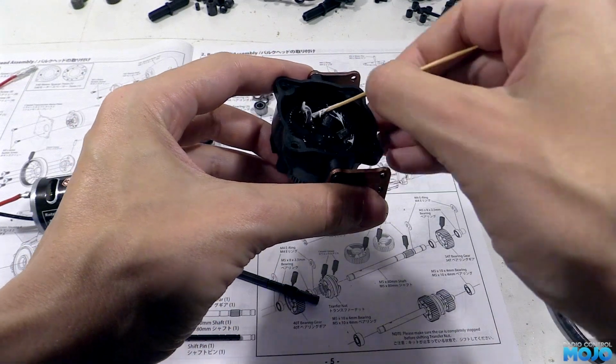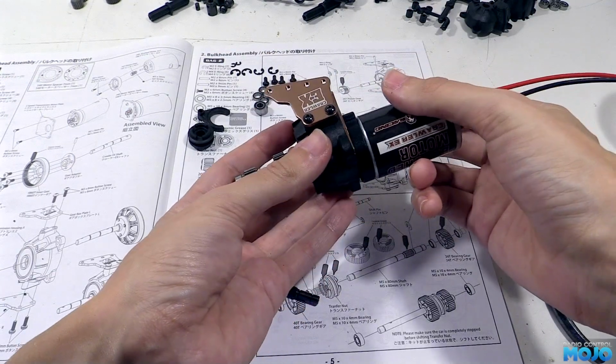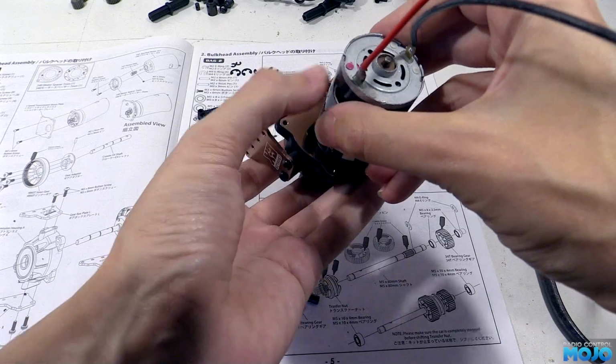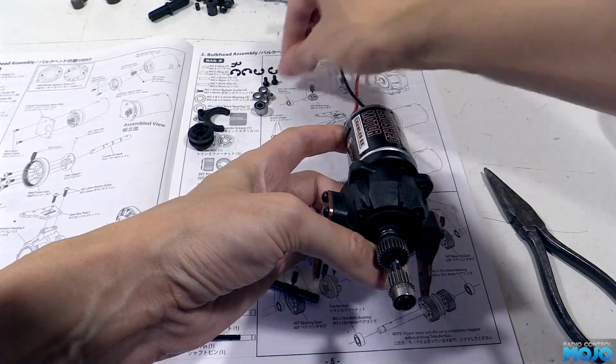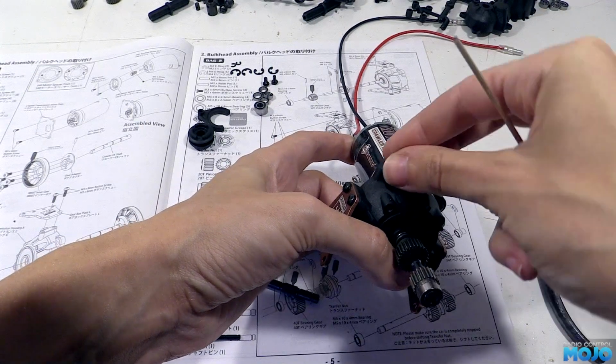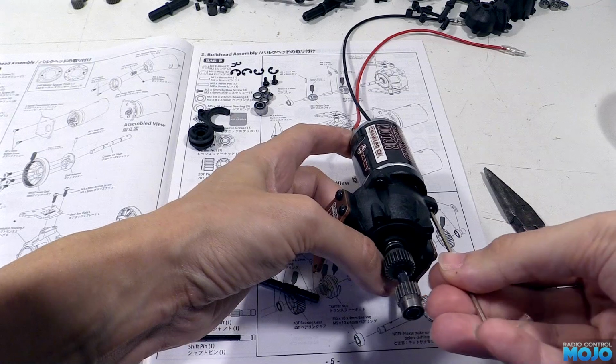For now we'll keep the pinion flush with the end of the shaft, which should leave us with plenty of clearance. We'll still fit the plate and the motor to the housing with 4 M3x6s. We just need to remember to check the pinion position once it's all put together. We'll need to add some thread lock too when we're sure it's all in the right spot.